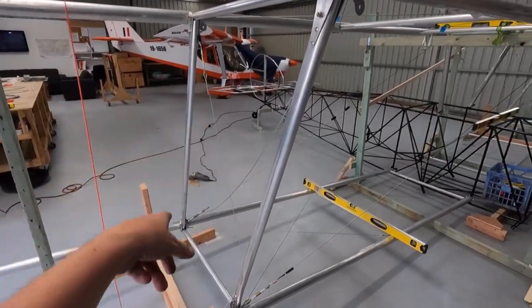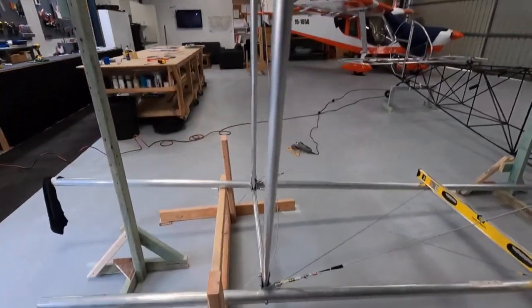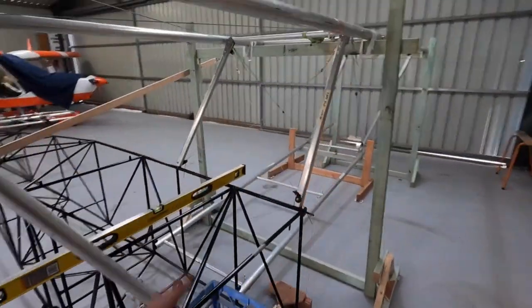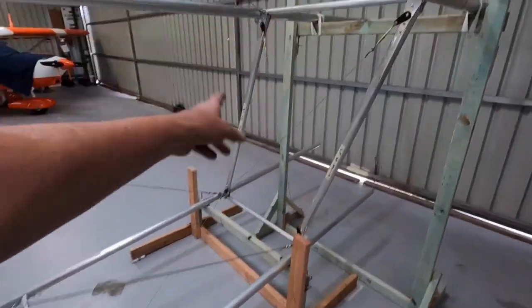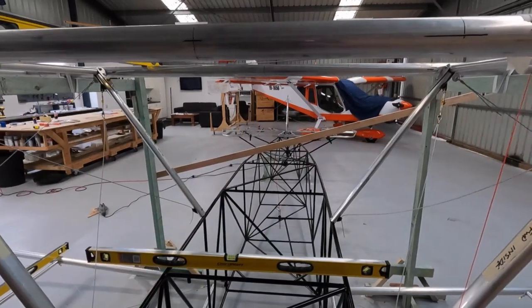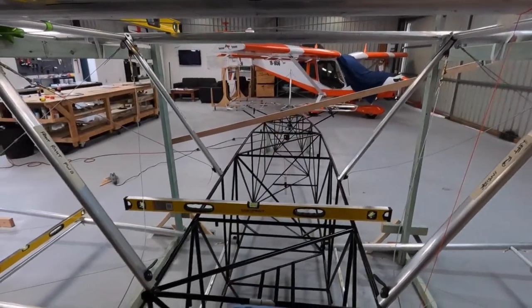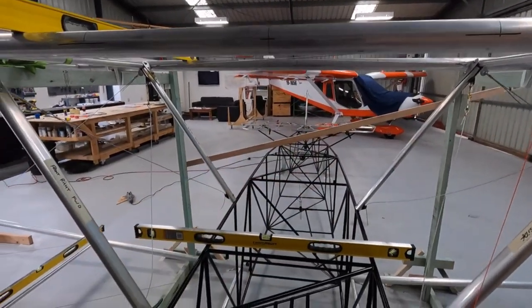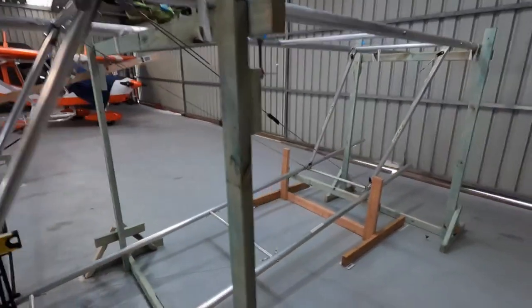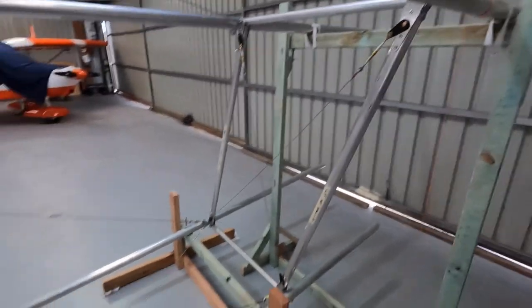So I just smashed out the cross wires and landing wires — they're basically done but not tweaked up. These ones are swaged at the top with the turnbuckles and I haven't done the bottom yet. Cross wires here, cross wires there, landing wires, cross wires. I need to now make — this has a little square piece above the machine gun, like a little torpedo. Rather than go from here up to there, it'll intersect the turtle deck — the hump and the machine guns. So you need to raise that point up where they all join. Might do it with string first. That's not a bad afternoon's work — smashing those out.